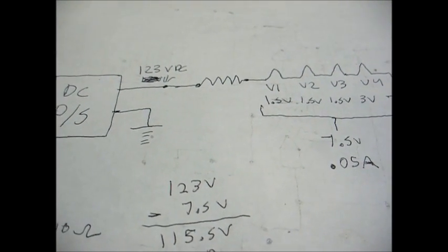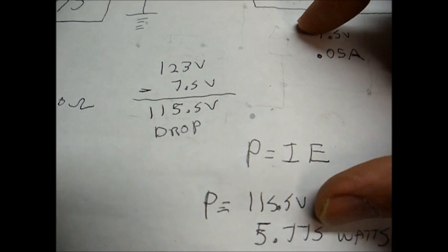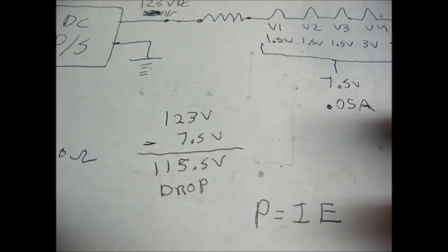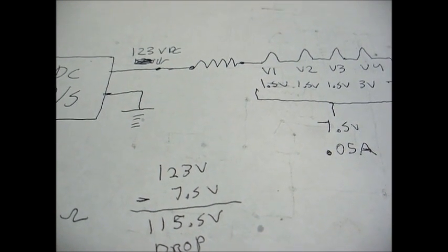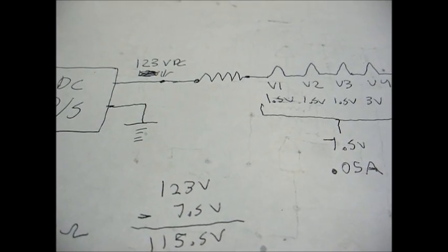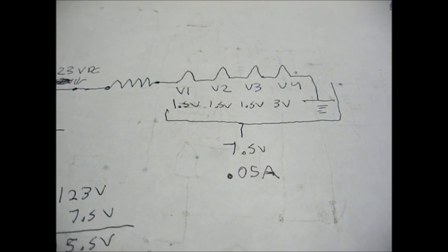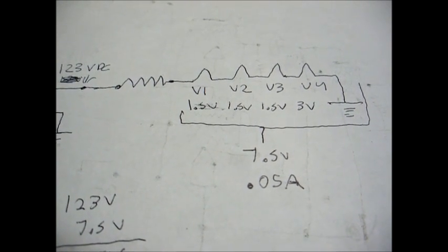Now, we don't want to use a resistor that's rated right on the borderline, as in we don't want to use a 5-watt resistor here. That'd be cutting it too close, and the resistor would probably burn open prematurely. The original resistor was probably a 7-watt resistor, and those are really not that common anymore, so we'll probably end up going with a 10-watt resistor. I'll have to do some checking online to see if any of these flex resistors are even still available, because I'd rather put one of those in there if I can. If I have to go with a standard power resistor, I'll have to get creative in the mounting of said resistor, but you know, in the case of vintage electronic repair, we do what we have to do.